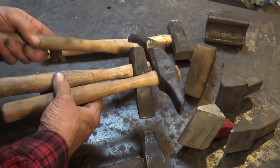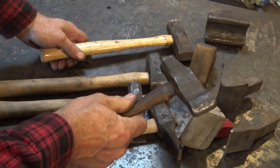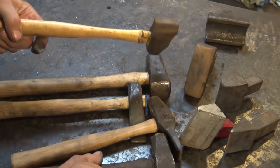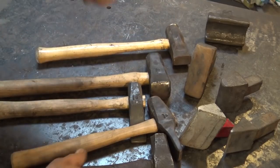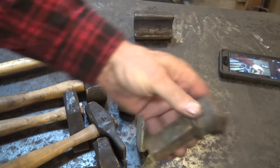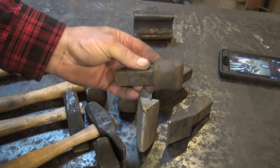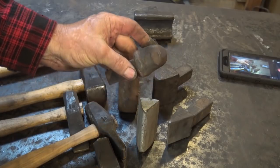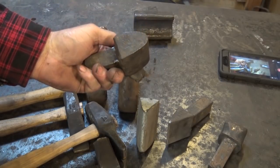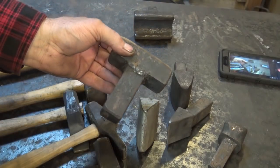These are all fullers that I made, all made out of 4140 — that makes a very good fuller. This is a commercially made fuller, and this V-fuller looks like it's probably a shop-made fuller that I got used; I don't know where it was made or when. Bottom fullers of course come in the same assortment and range of sizes. This is probably the first fuller I ever made — it's crooked, it's off-center, it's made out of an old axle shaft, but it still works. And these are all store-bought, commercially made fullers. This one is fabricated — the curve is just ground in and the hardy shank is just welded on.